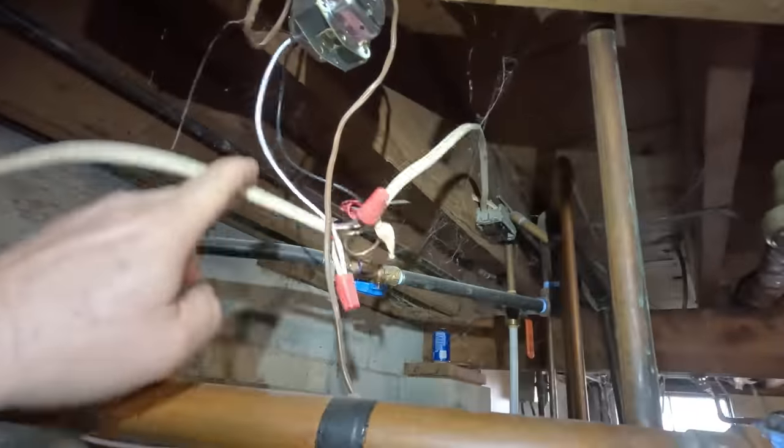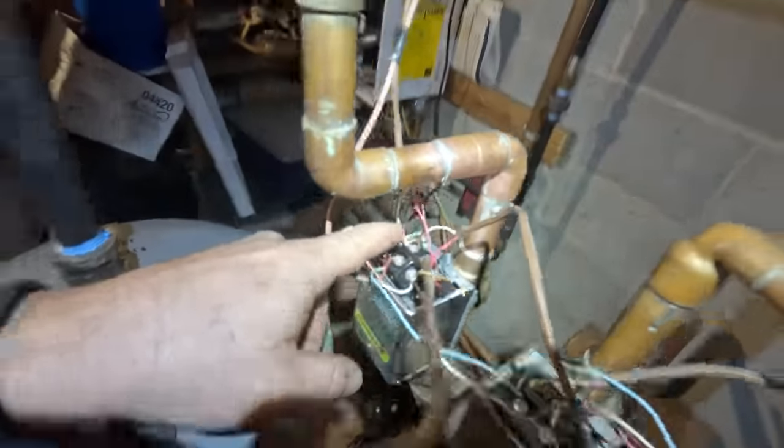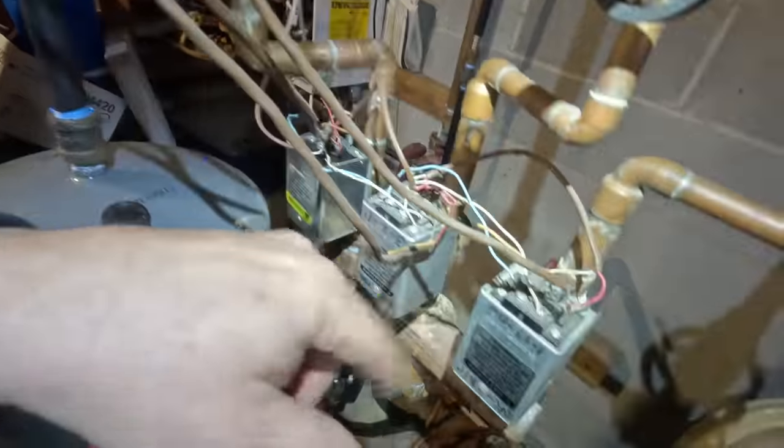It's not leaking now, but come over here and look at this nightmare of wiring — this rat's nest is ridiculous. Nothing's labeled, you've got insulation missing, wire just twisted together. I mean, how it hasn't shorted out is beyond me. This jumps from end switch to switch, and it broke off as soon as I moved it. I'm redoing this.